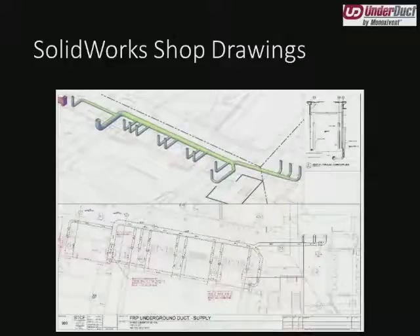Here we see an example of some of the 3D drawings we provide, laying them out on the contract documents, trying to get them as accurate as possible. Because we provide factory assembly or manifolding, these drawings become very important for the customer to verify every dimension. Especially with a document like this, we can't be 100% certain what the risers are going to be — that's up to our customer to let us know how long they'd like these lengths so all the taps can be located in our shop and ship with everything already on.